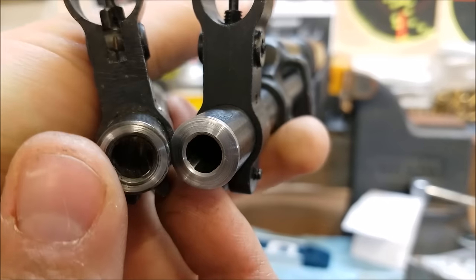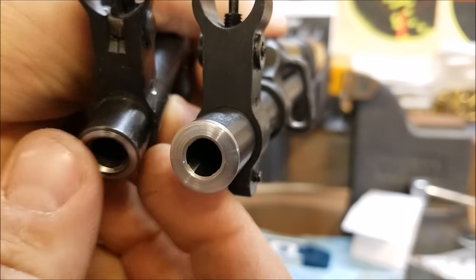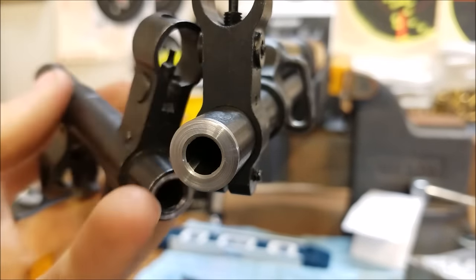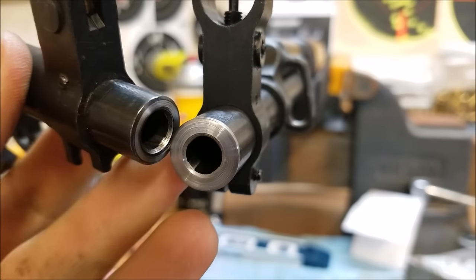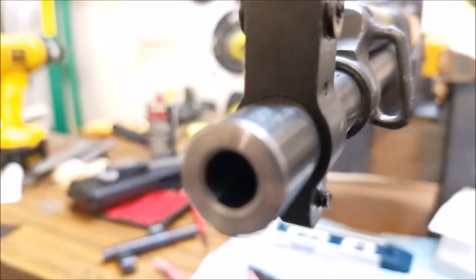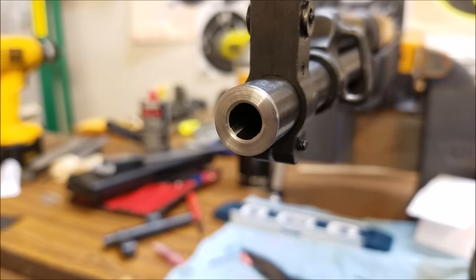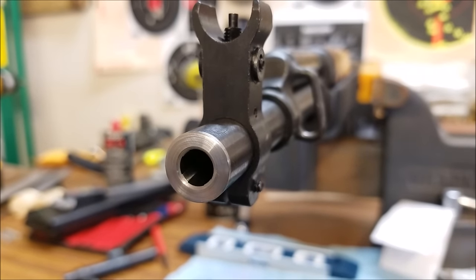The factory crown is a little bit deeper than this one, but that's just fine. If you want to make it deeper, you can just stay on it a little bit more with the brass and the lapping compound — it's up to you. Looks pretty good, I'm really happy with it. It's definitely going to do what I need it to do. Stay tuned and make sure you subscribe if you want to see the video on threading the barrel. I've already got my muzzle device on the way, so it should be pretty fun. If you have any questions or comments, let me know — thanks for watching.